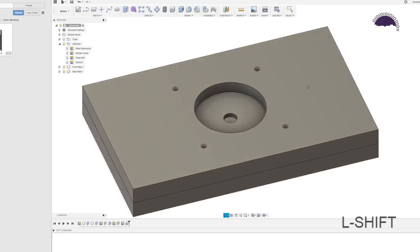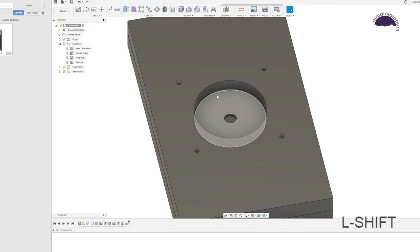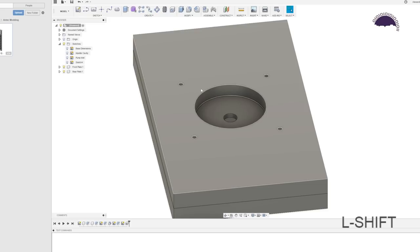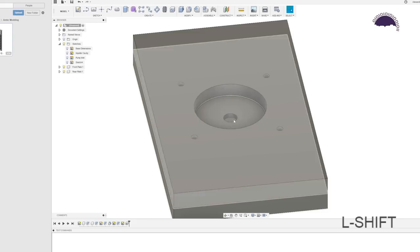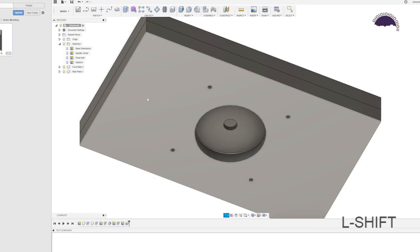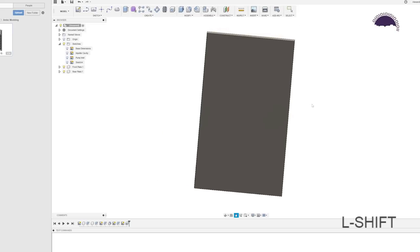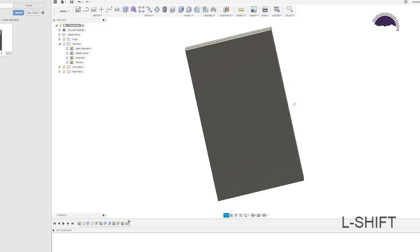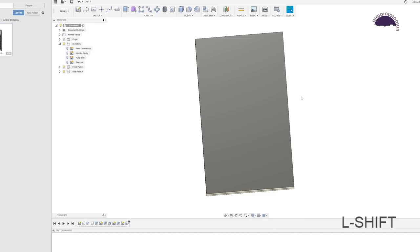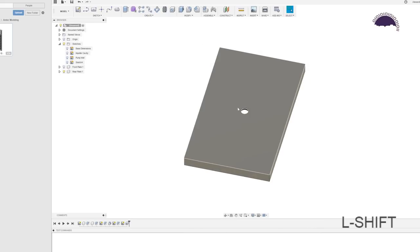That's the actual pump integration itself. All we need to do now is add the inlet and outlet channels. Let's look at the outlet channel first — that's the most important one as it does all the work. We need to add it to the same rear plate but from the other side. If you look at a pump top from the front, the impeller goes anti-clockwise — it goes clockwise from the rear — so you want the outlet running down this side of the circle. Let's make the front plate invisible and cut from the other side. New sketch.